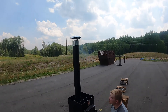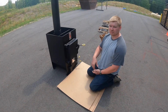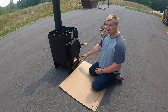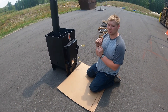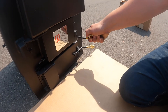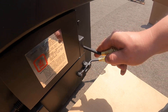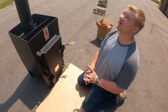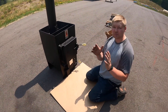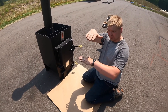It's been about another five minutes. As you can see the smoke has dissipated again from the chimney. The first thing we did was go from a hundred percent — lever all the way up — then we went to 75%, which is where the lever is now. The slightest adjustment in this lever makes quite a difference. We're going to reduce it to 25%. This might fluctuate a little — maybe a bit more here or there — but about 25% is good. Keep it at 25% for the rest of the burn until all the coals have burned down.